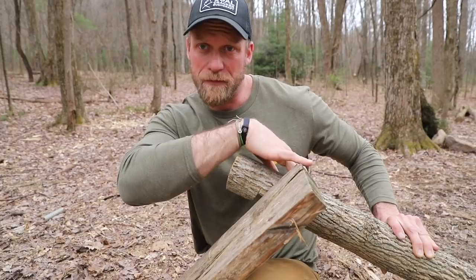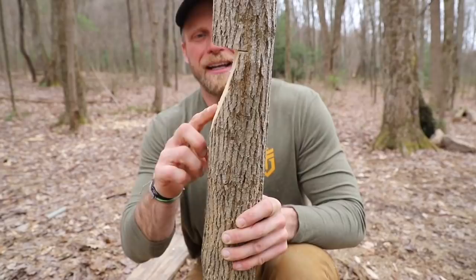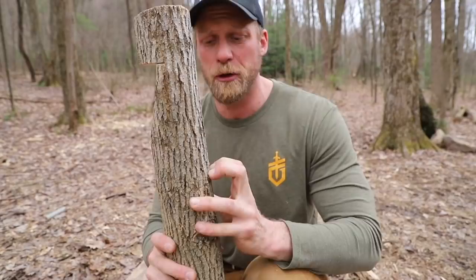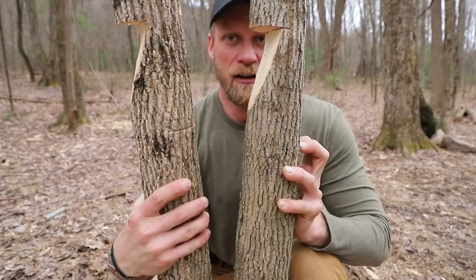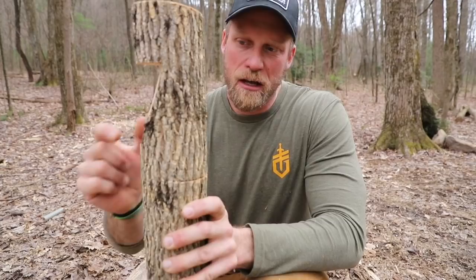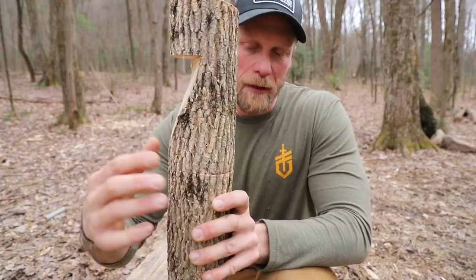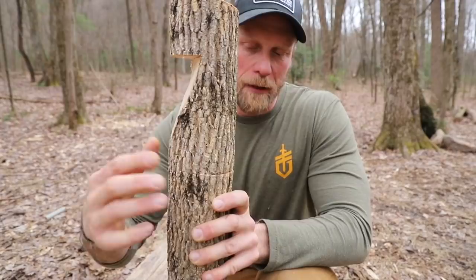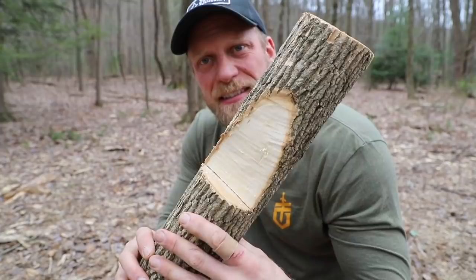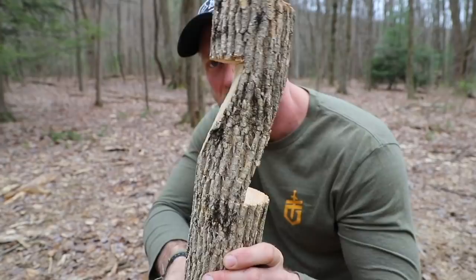So we have our seven notch here, we get that measurement with our hand on the board, lean the leg out, and we find this spot on the backside. We cut a straight line down into it — that's the stop cut. This second seven notch is going to be reversed: the flat section is going to be at the bottom of the leg rather than the top, and we taper inward from there. This will give a perception that the middle section is thinned out a little bit, and that's okay because all this friction is going to hold it together. Flat section at the bottom — chop this in with your axe and you'll be good to go. So we have our top seven notch and our bottom seven notch on each leg.